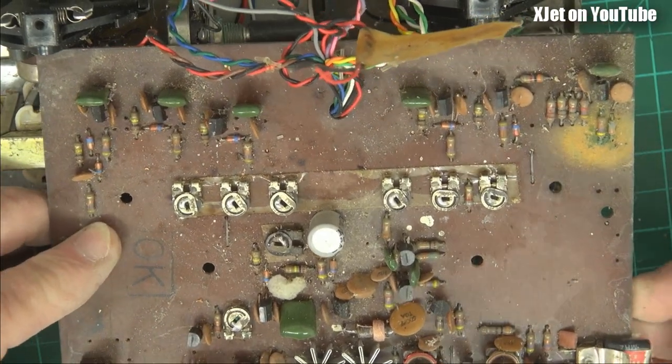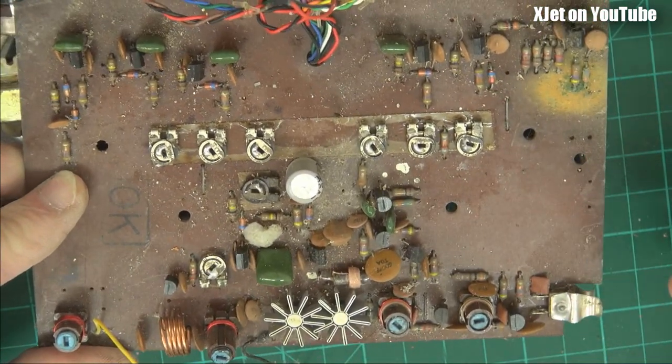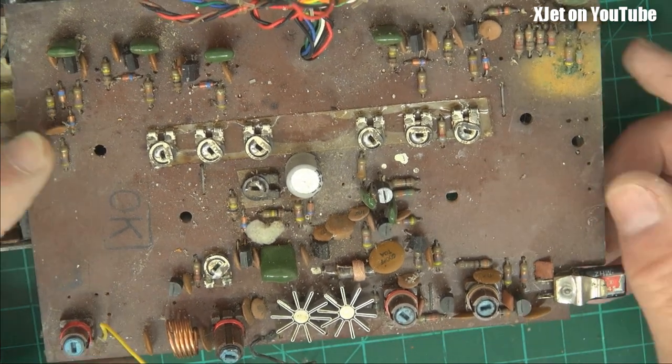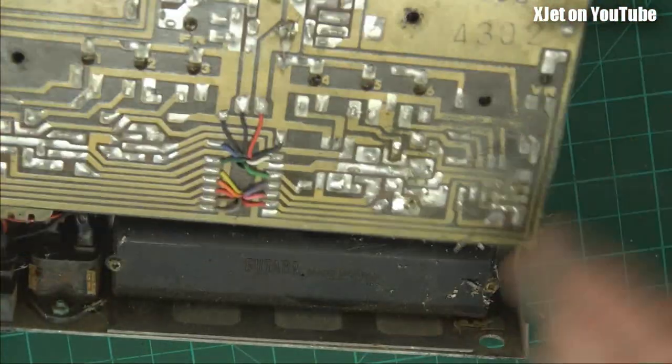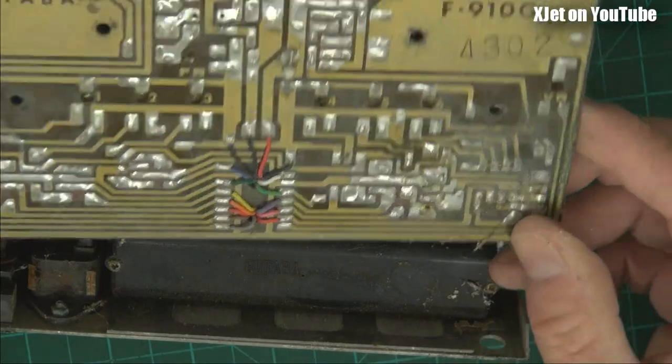This must be 27 megahertz. Even the little label on the crystals is coming apart. This is 27045 — so yeah, this is 27 megahertz. These are way back in the day. And this didn't corrode, fortunately, because even though the battery's gone, the battery in this one's in a plastic box, which has limited the amount of corrosion that's taken place.